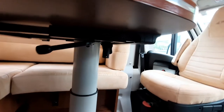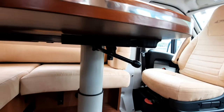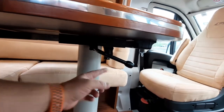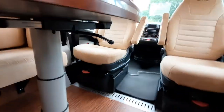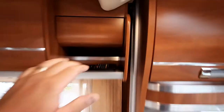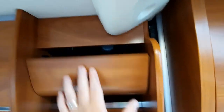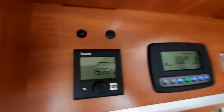Push the table down and lock it in place to set the height — that locks the height and allows you to move it left and right, forward and backwards. Located in this area is your manual winder point for the drop-down bed, which goes in down the side up here through that hole and allows the bed to wind down manually should the power go to the motor.